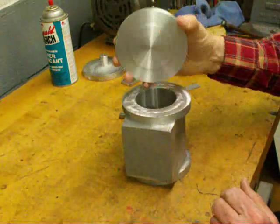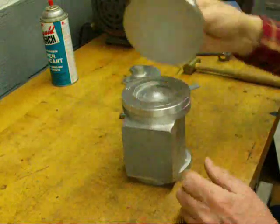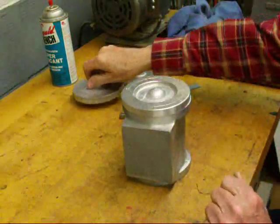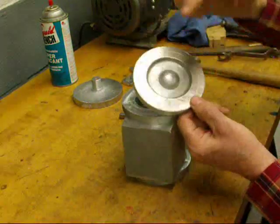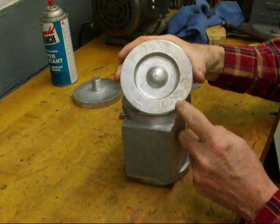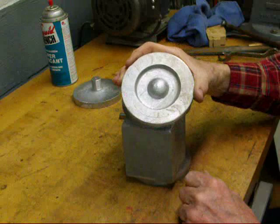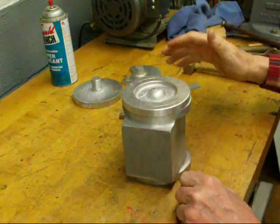See how nice that fits in there with that step. I'll do the same thing on the other end — I'm not going to show you how to make that piece because it's so similar to the head. Now I'm going to lay out six head bolts. Notice that I made a little groove here on the lathe with a sharp tool. There are several ways to lay out six holes.